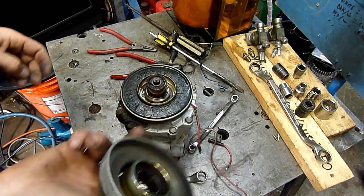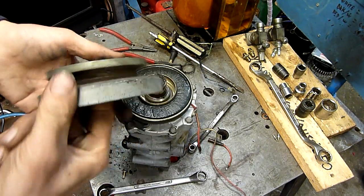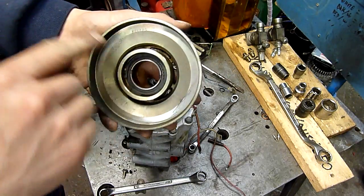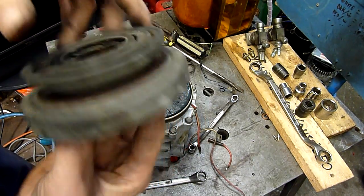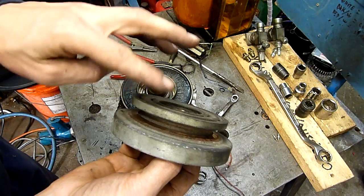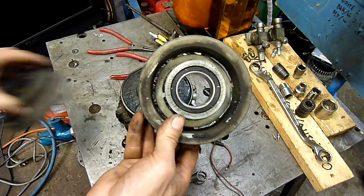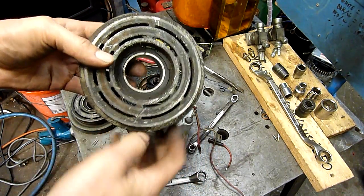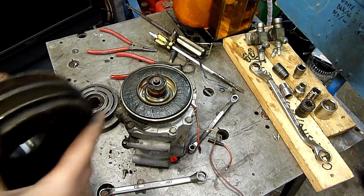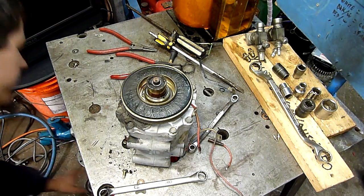I like it when they come off easy — not bashing this one against the table. The bearing's still good. These are handy because you can punch all this bearing out, machine a spigot of steel to fit in there, weld it, and re-bore it so you can mount this pulley on anything. You don't have to disregard the clutch surface — machine it flatter or just chamfer these surfaces and you've got yourself a nice engine pulley. Probably a bit more effort than going down the shop and buying one for $40, but at least you're recycling.